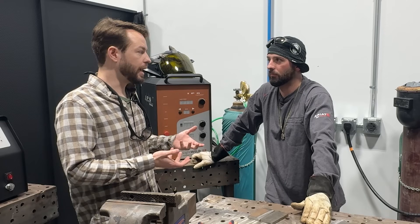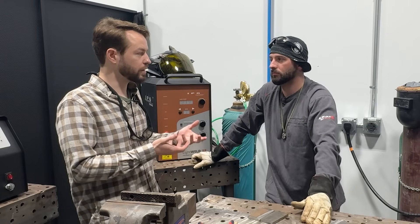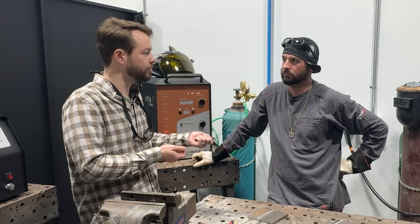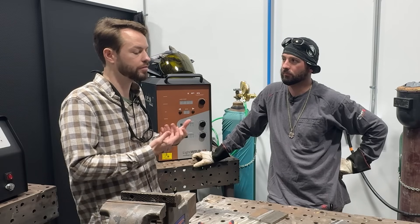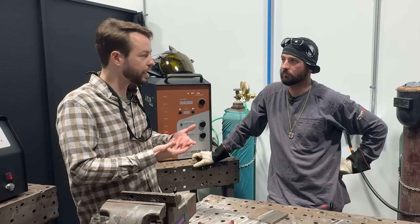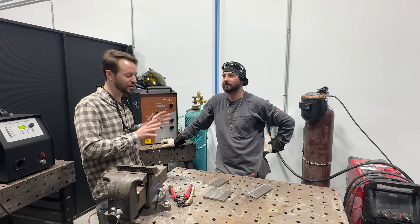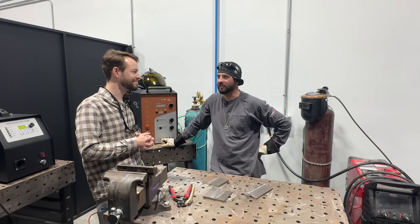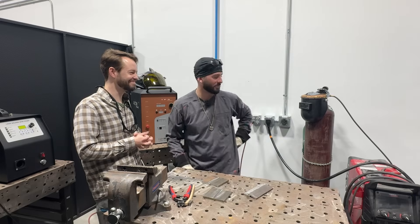With the laser, one inch of wire is one inch of weld. So if you do want a bigger fillet you either need to go with the dual wire feed system or find a way to feed a bigger filler rod into the material. With what we're doing today we only have .045 wire. There's some really cool stuff still in the works — some exciting hardware developments down the line. I'm thinking some laser Texas TIG-ing is in store for today's episode.